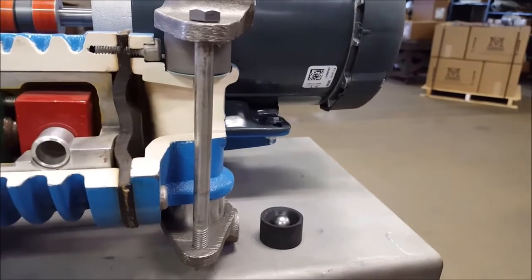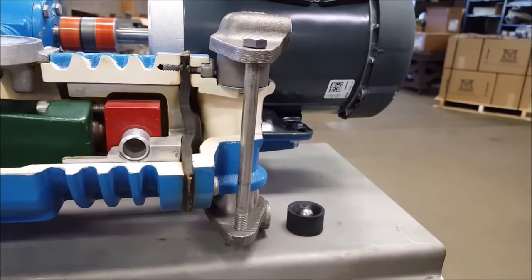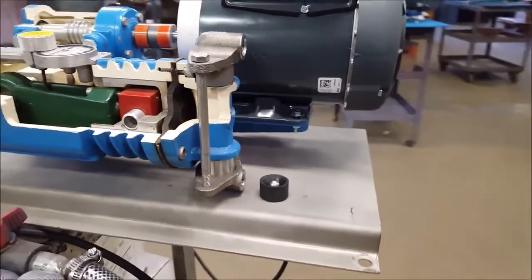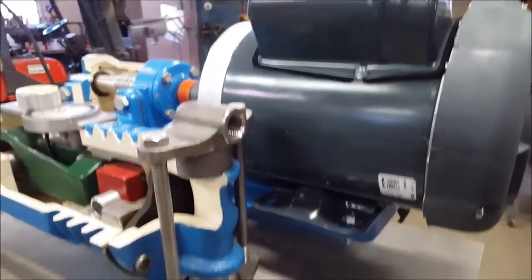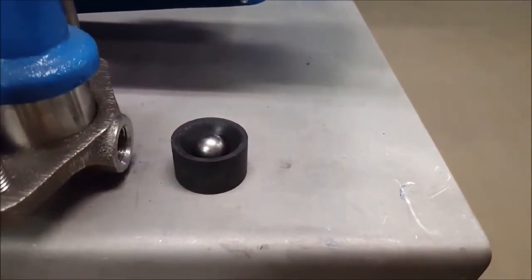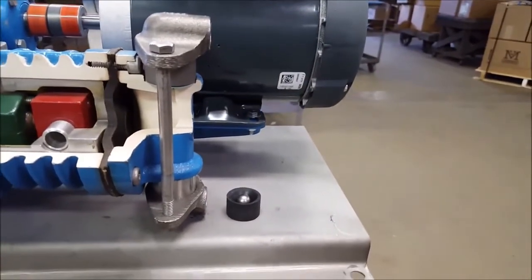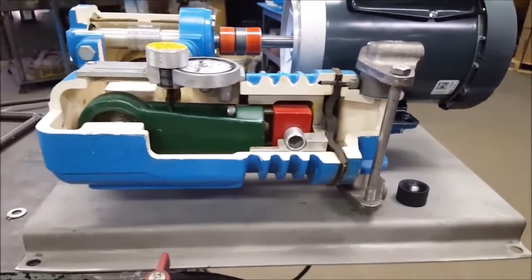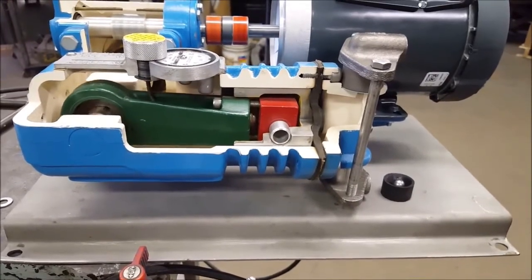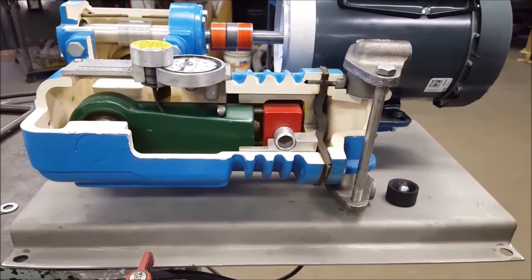Displacement is achieved via the backwards motion of the diaphragm sucking the liquid into the chamber and the forward motion pushing the liquid out. Sitting at both the inlet and outlet portions of the pump are check ball valves. When the piston and diaphragm are drawn backwards, the bottom check ball floats up off its seat, allowing liquid in, and at the same time, the top check ball is being sucked or pulled down tight to its seat, not allowing any liquid out. The opposite happens when the piston and diaphragm are then moving forward, thus resulting in even and accurate metering.